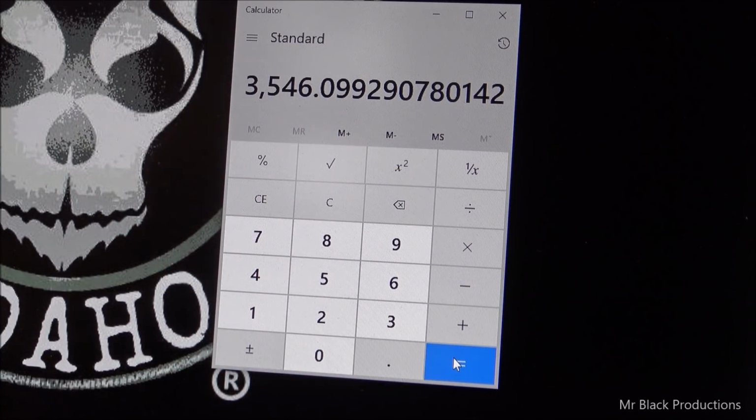If you can allow him to skip over this process of having to interface with the calculator and just say, hey, I'm looking for a 220. My primary voltage, I'm looking for 220, 230, 240. Secondary voltage, I'm looking for 3,500, 4,200, and 5,600. And I need that top tap to be rated at 3.5 amps.